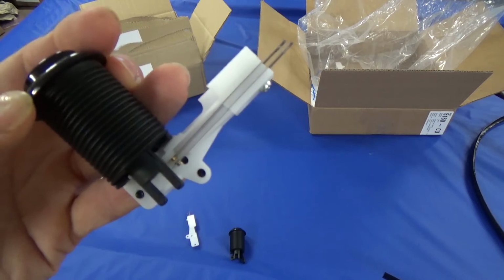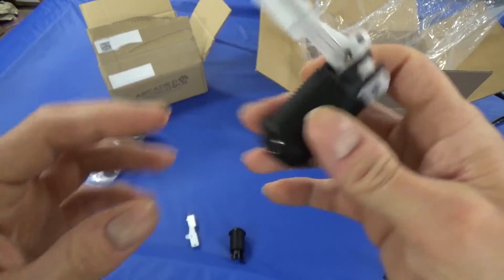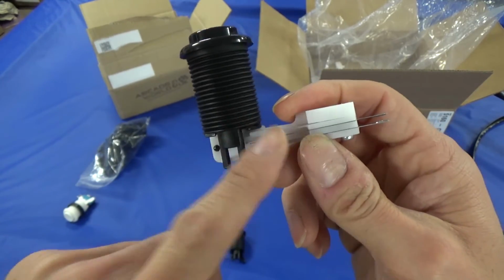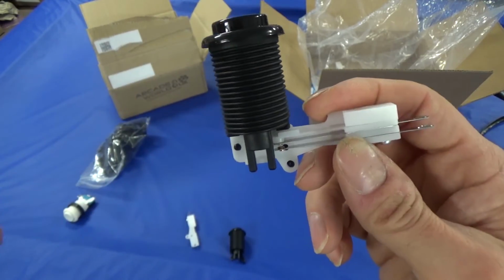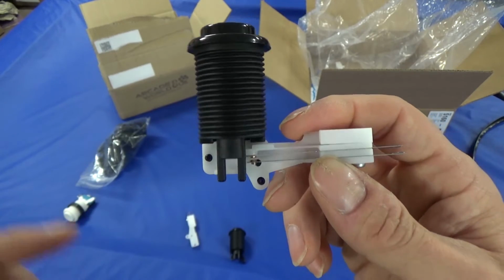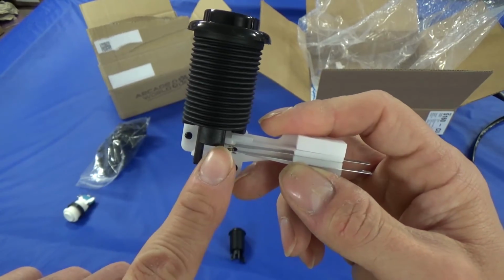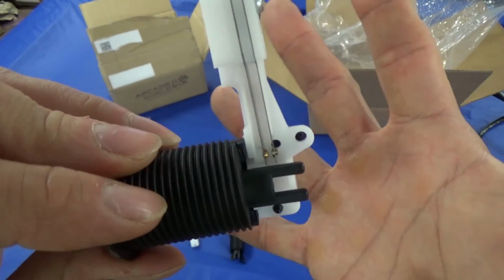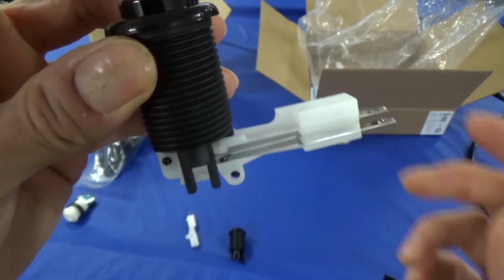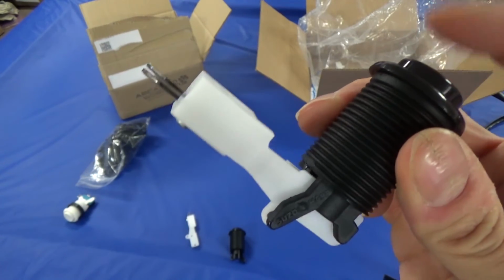And you know what, I might even think of putting all this in the bar top and on the arcade cabs. The only thing that you can't use these leaf switches for is LED buttons. There's no reason why you can't mod it yourself by drilling a hole and putting in the LED there. The LEDs normally go up there, so they need a separate end, and with this type of switch you can't do that. But there's no reason why you can't drill into the side and put your LED that way. But that's it, guys, look at that. It's gonna feel exactly like the original Gauntlet buttons.